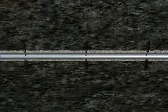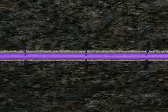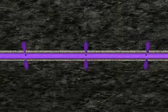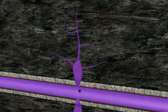After the coiled tubing BHA is removed from the wellbore, proppant-laden frac fluids are pumped from surface to fracture the formation. As pressure builds beyond the compressive stress of the formation, fractures form, splitting the rock apart.